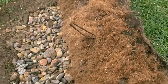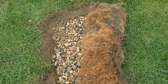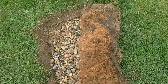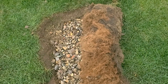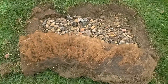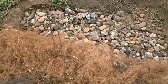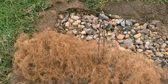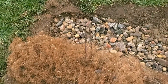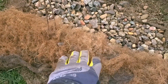There are many different types of fabrics out there, so beware. I've been told by subscribers that Menards fabric doesn't drain worth a crap — they're not punching the fabric. Non-woven geotextile fabric is such a broad category; we're talking tens of thousands of fabrics out there. It's really rare to get one that's punched, let alone double-punched. I know this because I know how hard it was to get a manufacturer to do it.